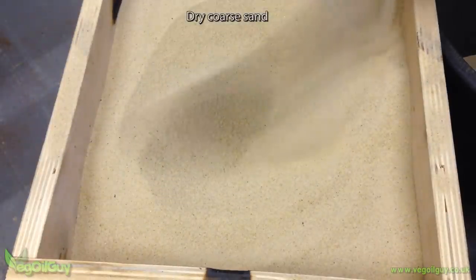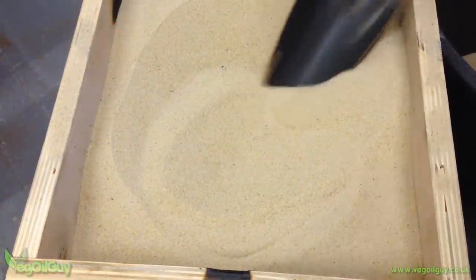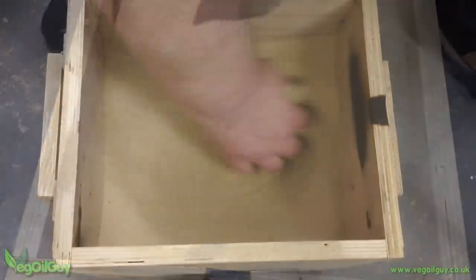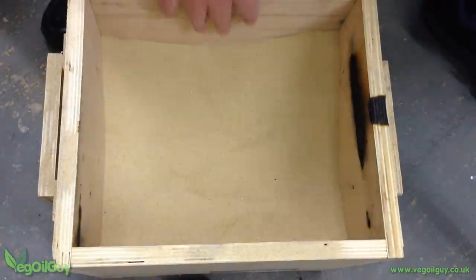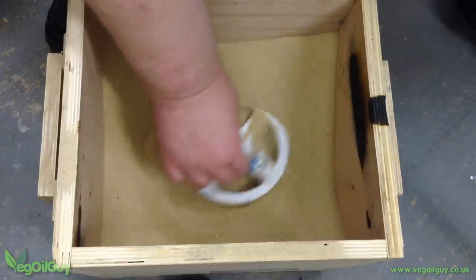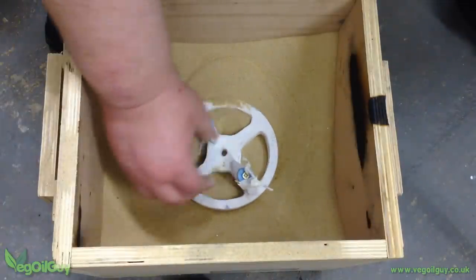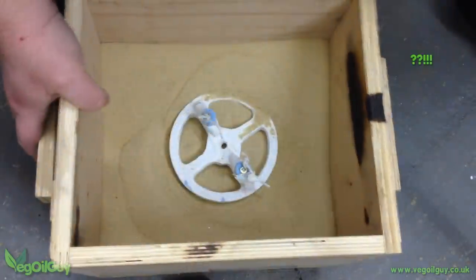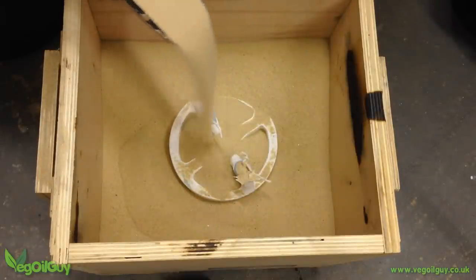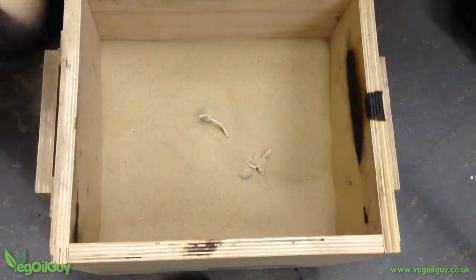Here's my box of dry sand. Ideally you're looking for fine but coarse sand — I know this sounds a bit contradictory, but it's basically just small grains of sand that have a rough texture. This is block paving sand and it seems to fit the bill nicely. I've emptied this box, leaving just 2–3 inches of sand at the bottom, then the pattern is placed inside — or rather, gently shook into place. I'm agitating the pattern and forcing the sand to flow around it, trying to fully support the pattern and remove any voids. I poured slowly from quite a height, encouraging the sand to scatter as it landed, then added more sand — just enough to submerge the gates.